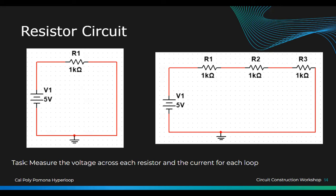Yeah. Next, you're going to get your black and red leads, or your positive and minus, from your power supply and put it into one of the power rails. So you can choose either the right or the left, whatever fits your setup. Make sure you know which one's positive and which one's negative on your power rails. Can you read off the silkscreen? We can use the positive link. All right, there we go. So now what have we created? We have created the 5-volt line, right? The 5-volt power supply.